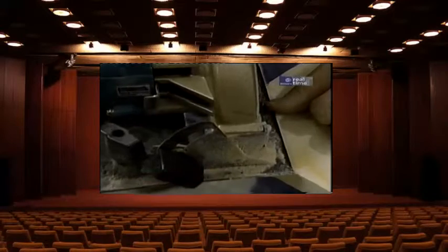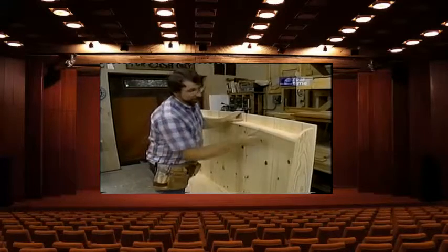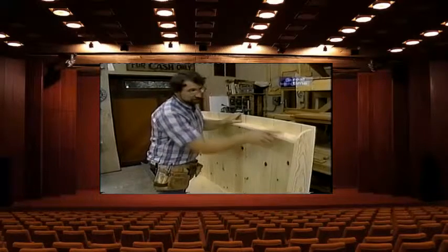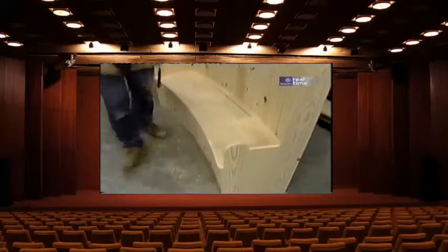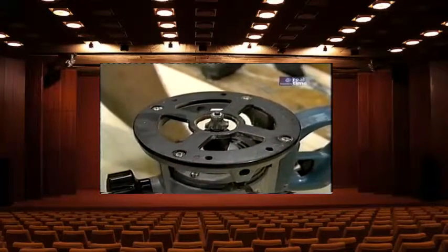I've fitted the sides to the seat, which allows me to put a little mark where the seat meets the front edge. I want to knock off this corner, just like they did on the original. Before any assembly, there's one more operation — easing the front edges of this cross piece at the top and on the seat. I'll use my router set up with a quarter-inch bit barely sticking up; I don't want the full quarter round, just to kiss the edge and ease it slightly.